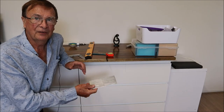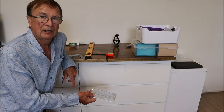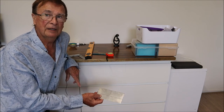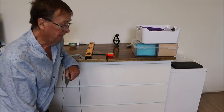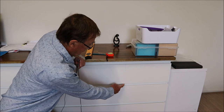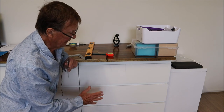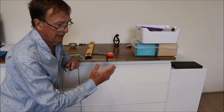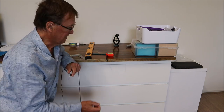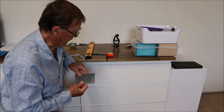The beauty of having a template is it just makes the rest of the job go very smoothly and you end up with a very accurate result — nothing's out of line, you can't make any mistakes with your measurements. If you're putting handles on all of these drawers, the first thing to do is set them up so they are lined correctly — adjust until the gaps are even and they're hanging perfectly in a line. That way when you put your handles on they're also in a line.